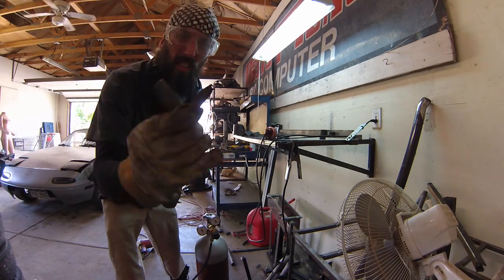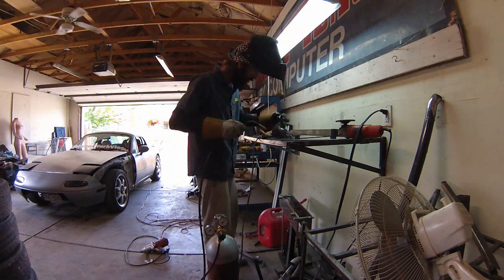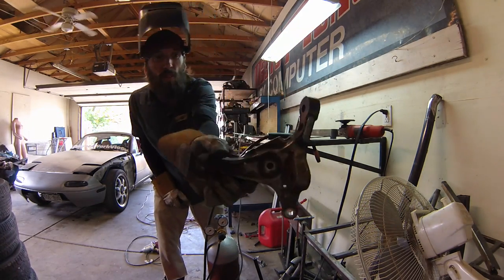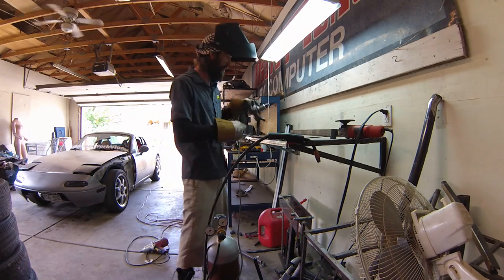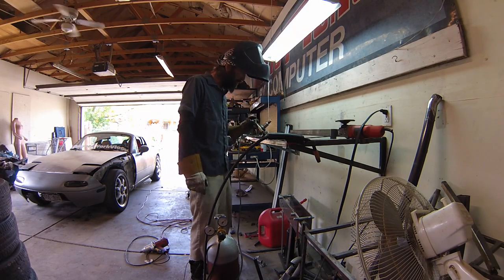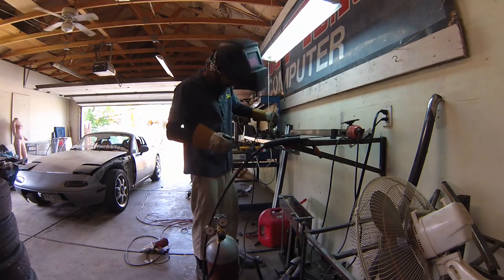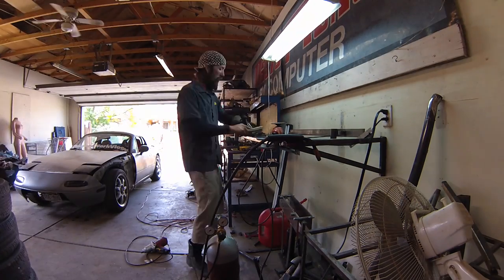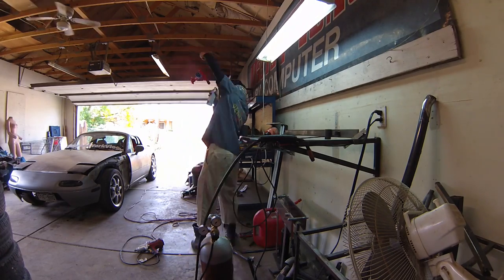I made a couple of pieces like this, attach them like this with a fat weld. As you can see, we've got a reinforced edge, reinforced side with some welds, and a little fat block on that side — should never bend now. We just clean that up once it cools, grind it nice and smooth, paint it, and it should be ready to rock and roll.